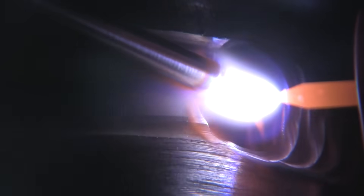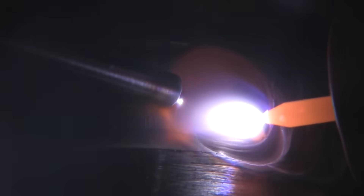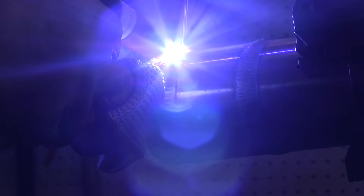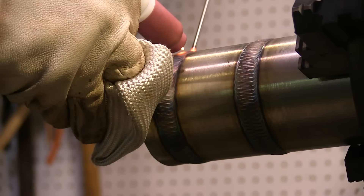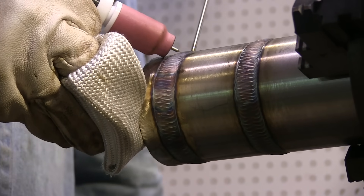Here's a nice close-up of that — just tying in those little hash marks I scored to resemble the bevels of a pipe's walls. Again, about 130 amps here. I'm not in any hurry to get my hand off of there because it's not even really warm.